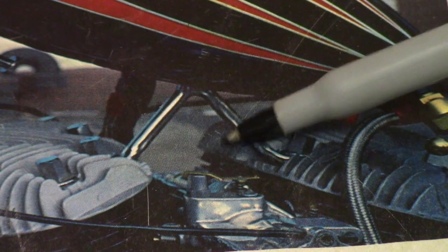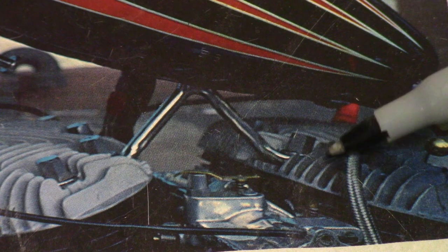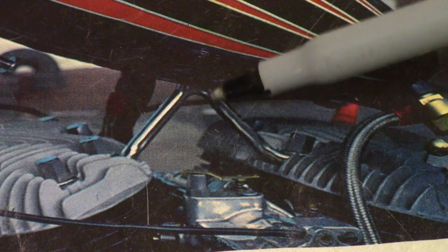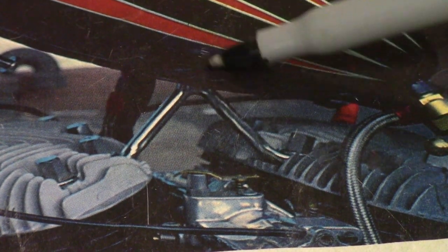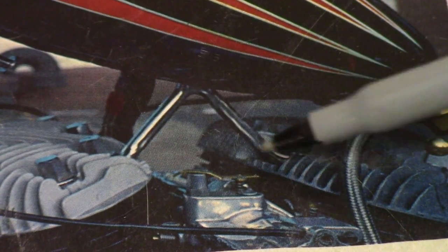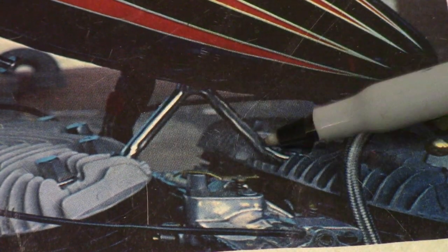All right, this picture here, guys, is the last one and the best one of them all. You can tell that's the half-inch round stock he used on the sissy bar, and how he's got it shaped right here goes to a flat piece of steel he used underneath the head bolt on either side. And up here you can tell it's almost attached the same way, and I'm betting that's a flat piece of steel just like that with a bolt straight through to the other side, kind of like a regular Harley mount. And this was a long time before Larry did a lot of his organic square stock twisty stuff, so we've got to go with simplicity here, and I'm betting that's how that was done. And you can kind of tell right here, the best picture of the motor mount.